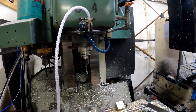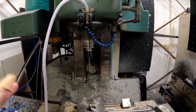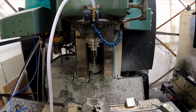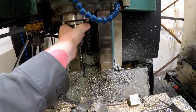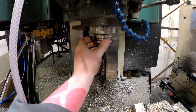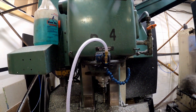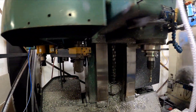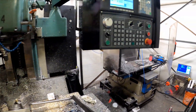Most of the machine is hydraulic, and the great thing with this machine is it has a two-speed gearbox. The low speed will do zero to 1,000 or 1,100 RPM, and the top speed will do 6,000. That's changed hydraulically. When it comes to change tool, there's this opposition, and there is a cam inside that a hydraulic plunger pushes into the cam and then aligns it. Everything about this is hydraulic, but it works great.